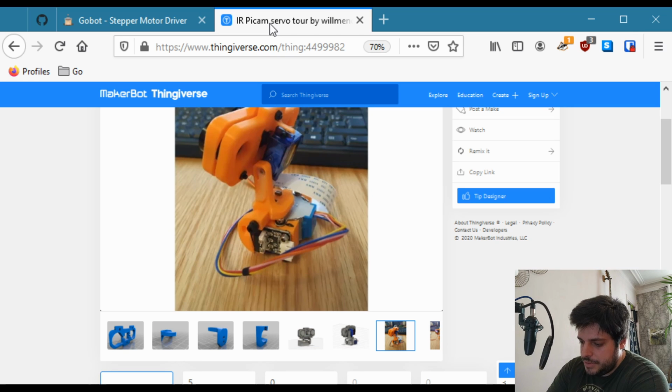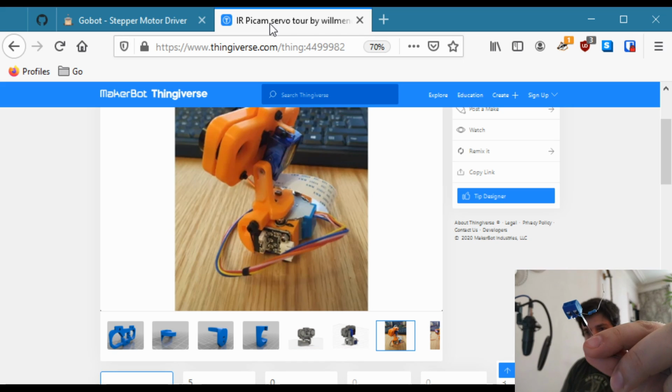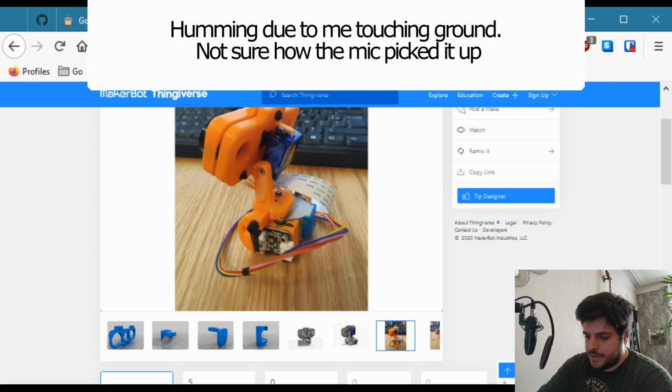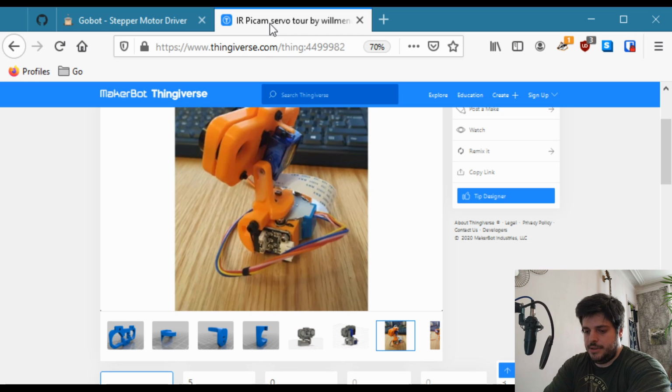So all this can be plugged on the Arduino. For the resistor, I've made this little stupid thing there in order not to solder anything. You need to put a resistor, otherwise you just short circuit the thing. So this is not ideal, but for prototyping it's good enough. And I'll put this in pin 4. Here we are.